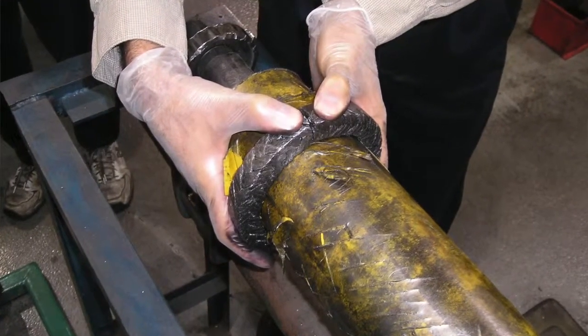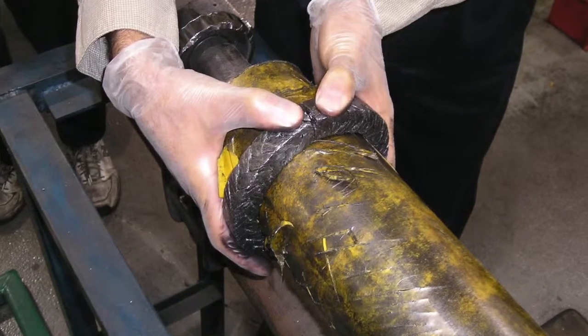Skillfully cutting rings with a mandrel does take some practice. Focusing on the end result with the rings fitting on the mandrel with no gap will quickly provide a feedback loop to perfect the practice. Each style of packing will pull around the mandrel slightly differently, so it's important to make sure each ring comes together perfectly.